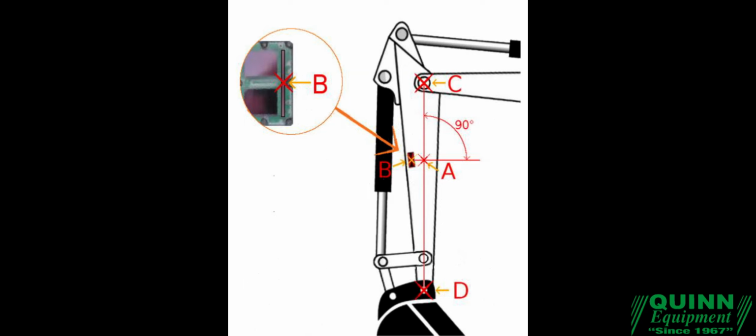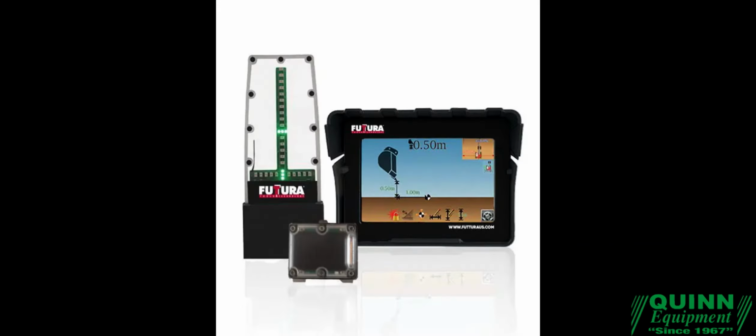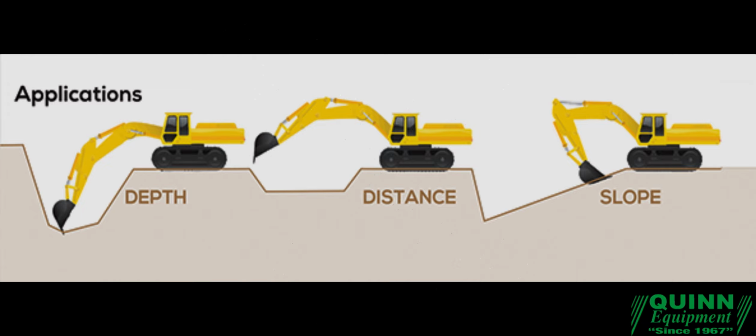Check the power outlet. Can the machine supply 12V and/or 24V? Is the power supply stable and does not drop or turn off? If power is not available, check for a blown fuse or corrosion in the receptacle. Does the cigarette lighter plug fit securely into the accessory plug?